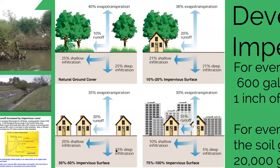Water cascades down into the rain garden and we get deep infiltration. We're mimicking the natural environment. When a natural ground cover system is rained on, about 25% of that water sinks deep into the ground, about 25% does shallow infiltration, about 10% runs off, and the other 40% evaporates. With rain being so precious to us, we want as much infiltration as possible. But the way we've constructed our cities is counter to that — we compact the soil during development and lose much of that infiltration capacity.